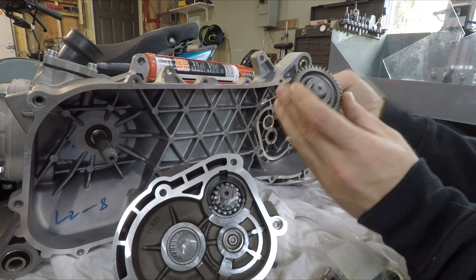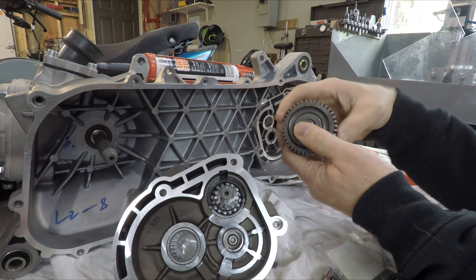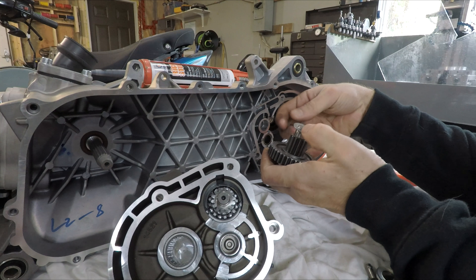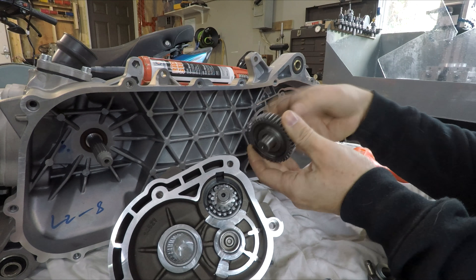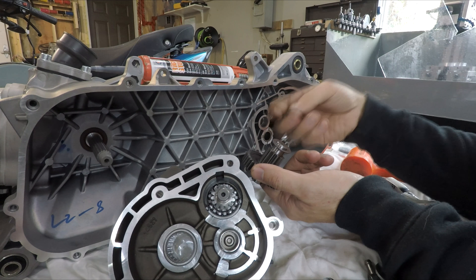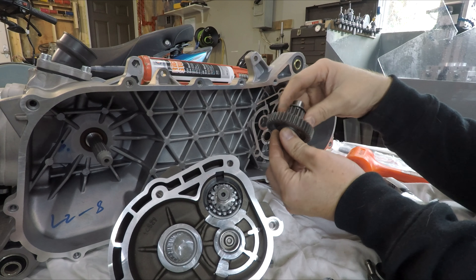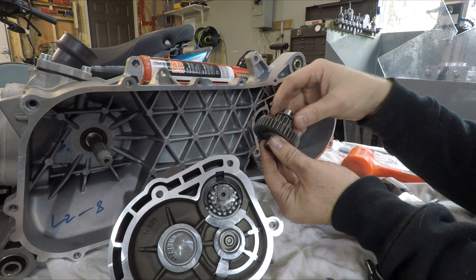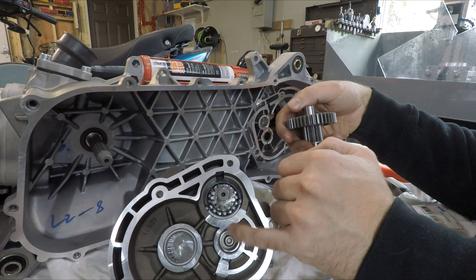The primary and secondary have to be coupled as well - these need to be pressed together. Same deal: heat this one up, leave this cool, use a press to push them together. These washers are not included with the transmission kit. Normally they'd sit on the ends of the shafts providing wear surfaces and act as a plain bearing thrust surface. I'm going to try with those in there - it may be too tight, but I know normally they're supposed to go there. That's what those grooves are cut for so oil can get in and act like a plain bearing.